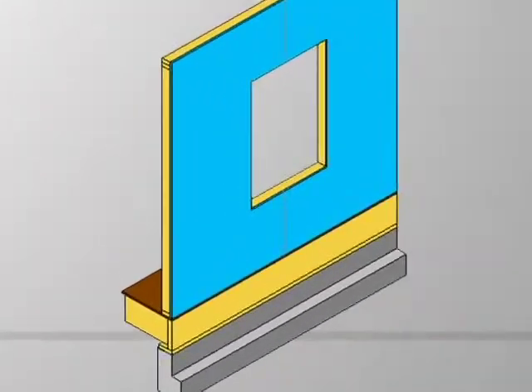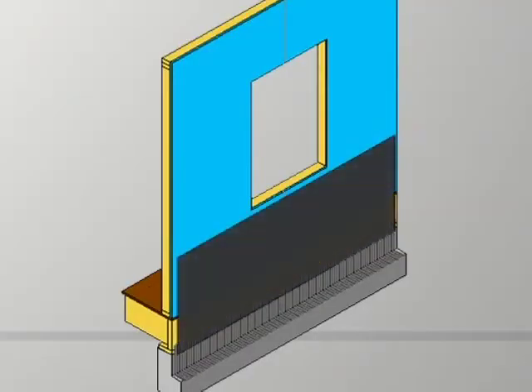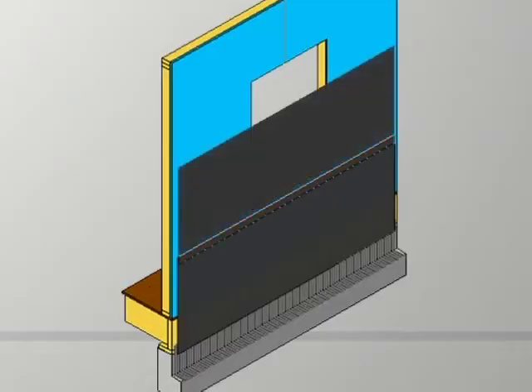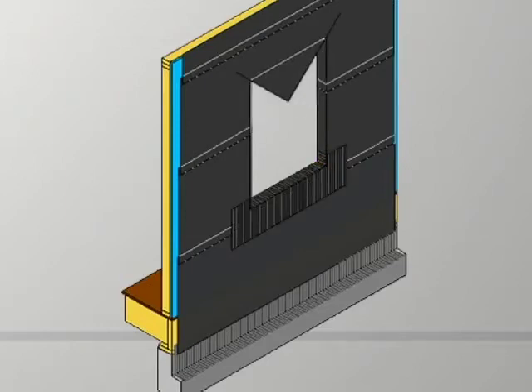I'd like you to notice how this process goes together from the base flashing all the way to the top of the window. At the base you have a recessed brick ledge, and the first thing you do as a mason is put on your base flashing. Then your paper would start up the wall, and as the paper is applied, each layer would lap about two inches according to code over the one under it, so that it shingles and the water can run to the base and exit the wall. At the rough openings, once they're crossed with the paper, you just cut the paper in the center of the opening and fold it in, tucking it into the opening — a little added protection — and then the paper continues on up to the top.